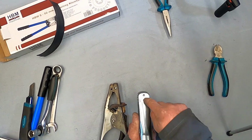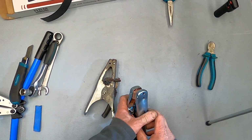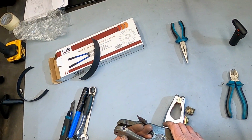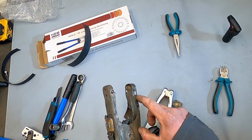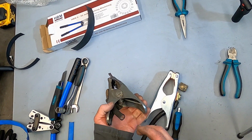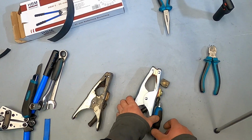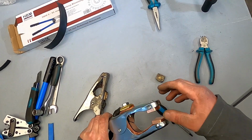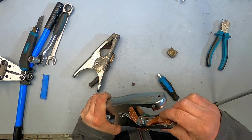And do not forget to sometimes tighten the bolts which are connected to the copper. If somebody is using this side for clamping instead of those parts, that's the problem, and then everything is going through the plates. This is not strong. The power should go through the cable, on the connection, and on the wire which is pointed from here and goes to the end of the clamp. And then there's not one cable; one is for the right, one is for the left.